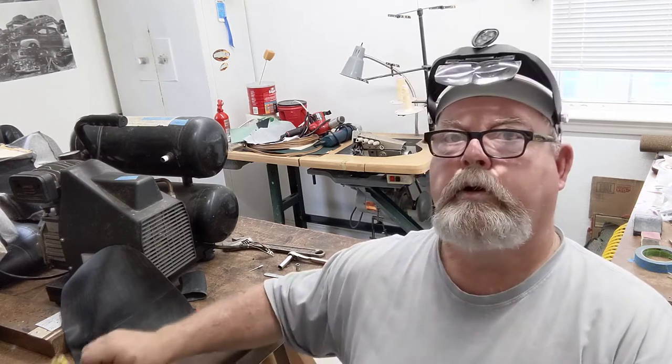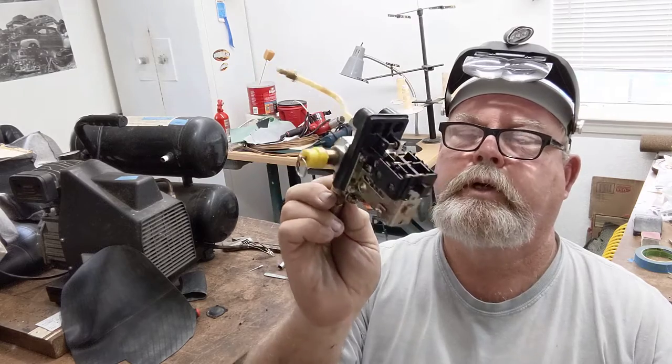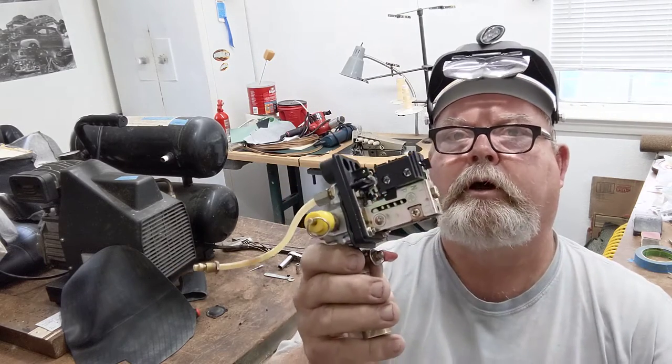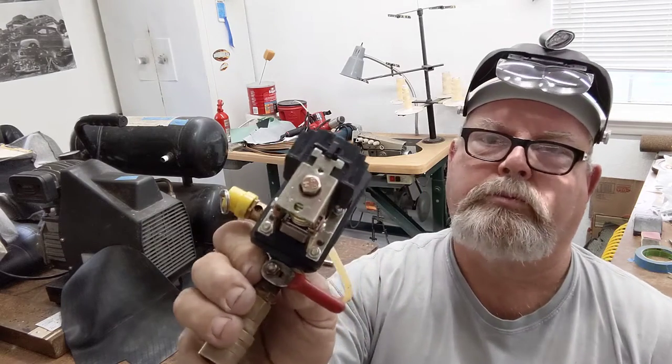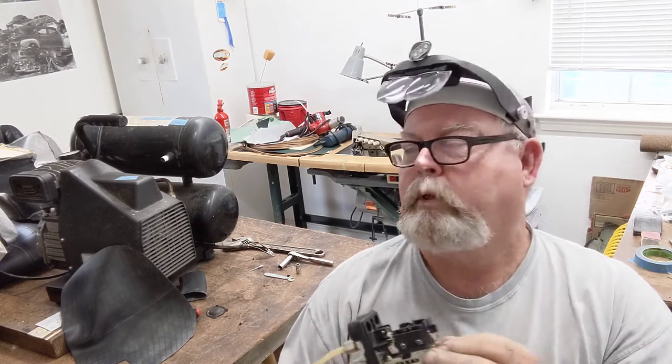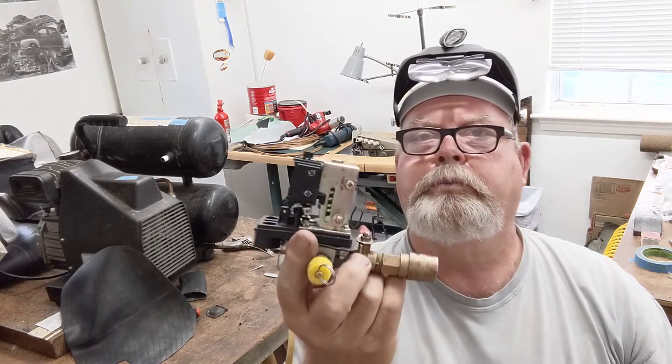There are a lot of good DIY videos on compressor regulators. I thought about buying a replacement regulator — got on Amazon and checked local suppliers — but $75 was the minimum I found for a Chinese regulator. The diaphragm repair yesterday worked, except the spring was out so it wouldn't shut off. I reset the pressure to 90 pounds — all I need. It's a six-gallon tank, and that's plenty. I use low pressure for gluing and around 50 pounds max for stapling.